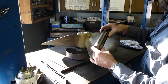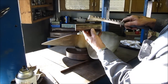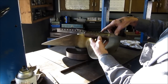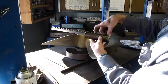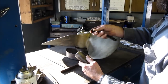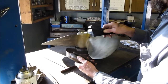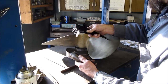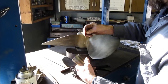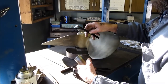This is a broach guide that I've made that feeds the broach through. As you push it, the teeth progressively take more and more with each tooth as it passes through the bore. Then you back up your next pass with a shim. I gave up on buying shims from broach kits — I save all my metal banding materials that come in off of shipped items and create my own shims out of those throwaway pieces of strapping.